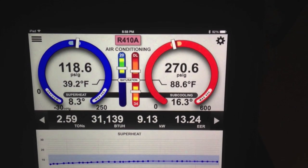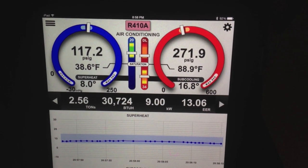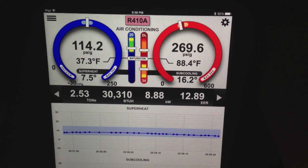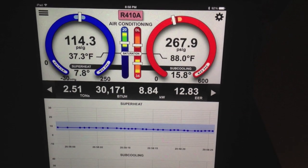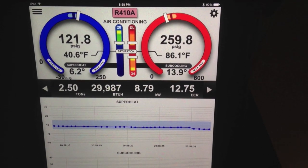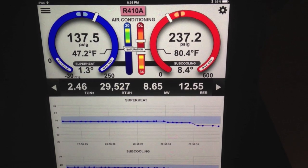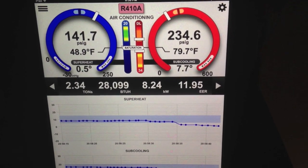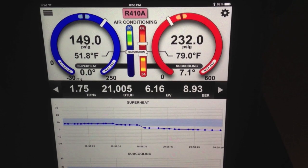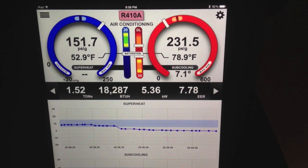So now I'm going to go ahead and shut this off just to give you an idea of how quickly things change. Alright, I just shut the thermostat off. The system takes just a second — okay, it just shut off now. And we'll watch how fast this thing starts dropping. So you can see very quickly when the system starts to settle out, we start losing that cooling. Now it's going to hang around just a minute because the coil is still cold — it's still got cold refrigerant in there. But as the refrigerant starts to warm up, the cooling capacity starts to drop off and the system goes back into doing basically nothing.